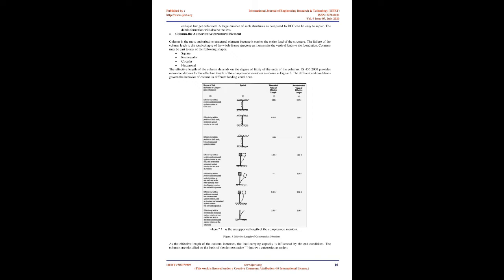It is manufactured with high cement content, low water cement ratio around 0.4, wire mesh layers, light structural steel, admixtures mainly silica fume, superplasticizers, non-metallic fibers, particularly when ferrocement is cast in situ. Therefore self-weight of ferrocement structure is very less as compared to RCC.